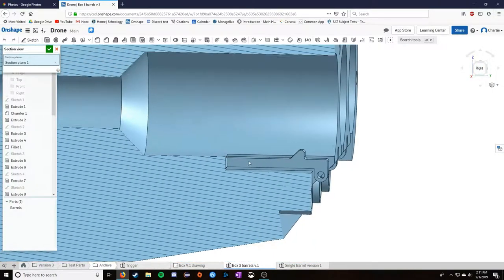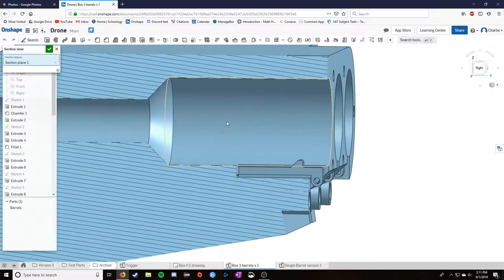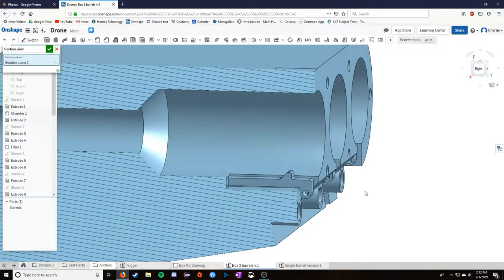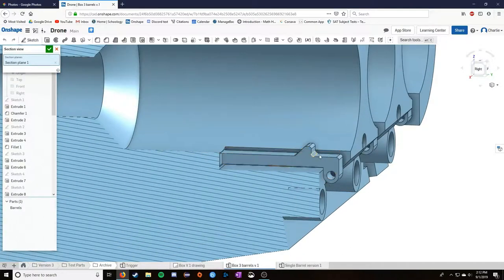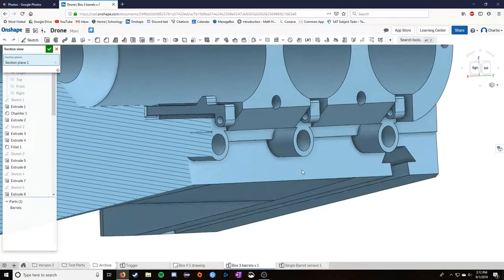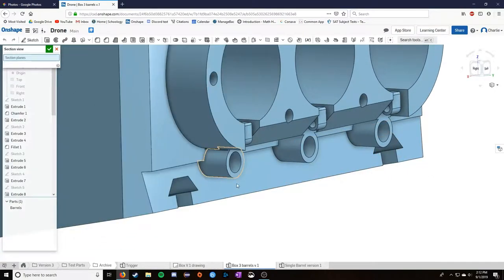Now what I was relying on was the plunger pulling back against a spring to build power, and the little ring of the plunger would pop over this. It's hard to explain this without seeing the plunger yourself, but bear with me because I don't have a model of that. It would have been a lot less effective if I had modeled the plunger myself. So the idea was it would push this down, get stuck over this little rim, and as soon as this got pulled down somehow, the plunger would shoot forward and launch the dart out with the pressure wave of the air. Now, this gets into where this sort of failed.